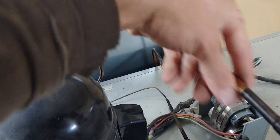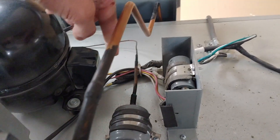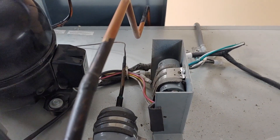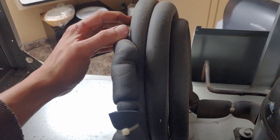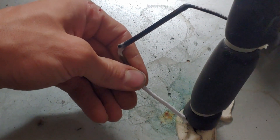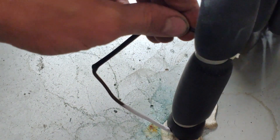The high side line goes over into this coil and here it's cold. It goes down into that trap and evaporates all the condensation this unit produces while it's in cooling mode. Then it runs through the coil and down through this liquid line filter dryer and out the capillary tube. But look right here — you can see at this point it's already frosting up. We don't want this line frosting up outside of the unit. That's a sign that the refrigerant is flashing from a liquid to a vapor right in this section, which indicates the system is low.